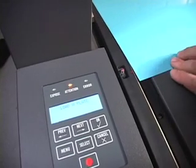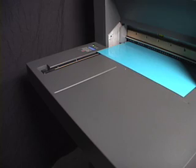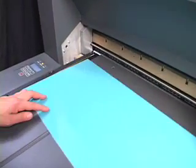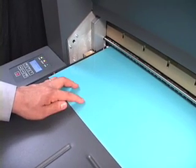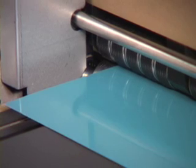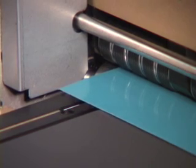Once the job is in queue, accurate registration from plate to plate is ensured using ECRM's patented registration system. For presses using edge registration, an operator simply slides the printing plate into position and makes contact with three electronic sensors. This locks the plate into position. Now the plate is moved into the imaging field by our patented segmented pinch roller assembly.